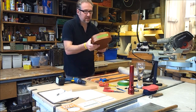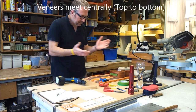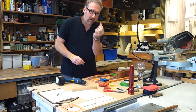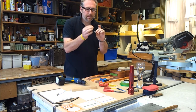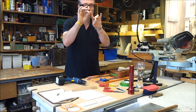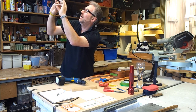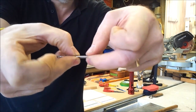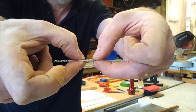Now I have to put a screw in there. No need to be scared at all. Basically, make sure you're using the correct pilot hole — you're going to need to drill the pilot hole. How do you know if it's the correct drill for the job? Easy. What you do is hold up the screw, then hold the drill in front of it — screw behind, drill in front. That's the flat end of the drill. You look up at the light, and if you can see the little bits of screw thread either side of the shank, then you know you've got the correct drill for the job.